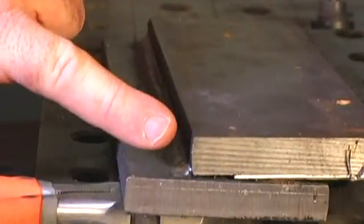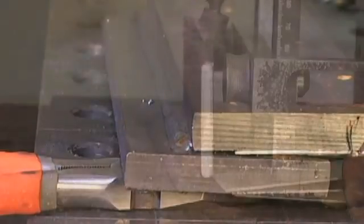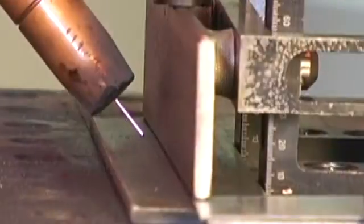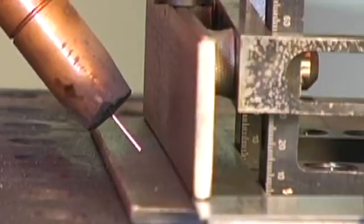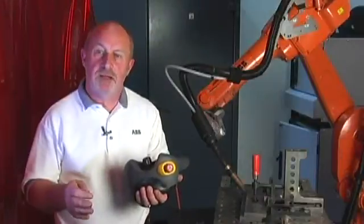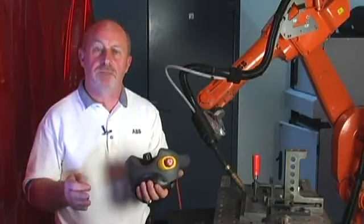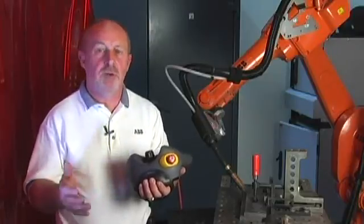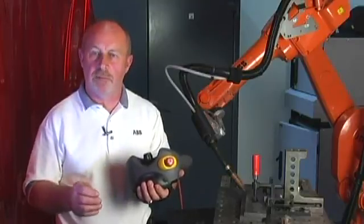The challenge in industry with most materials is there are gaps, whether it's by stack-up of tolerances or deviation through thermal influence of the welding. The robotic device needs to track very accurately where the two pieces meet. Today, the capability of seam tracking enables general industry to track difficult joints that previously couldn't be done before, or that only heavy industry or automotive could afford. They're now far more cost-effective and far more capable.